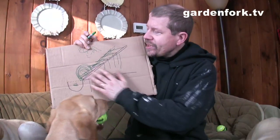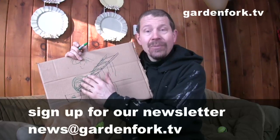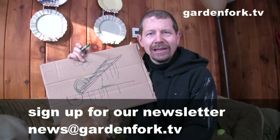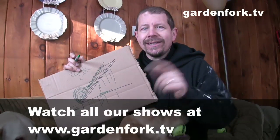Another reason you get ice dams is you don't have enough insulation here in your attic. You want to keep your roof as cold as you can. If the bottom of the roof is warm, the water's going to melt and then ice up, and that's a bad thing. So there's more information about ice dams on our site, gardenfork.tv.